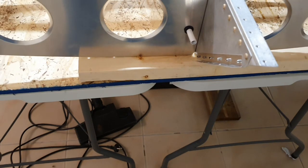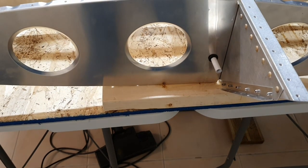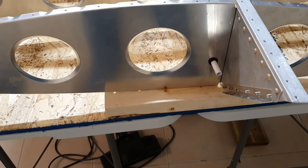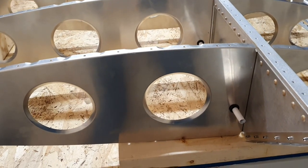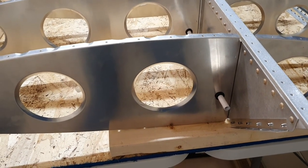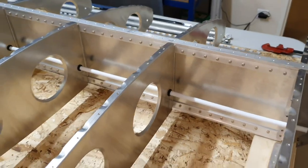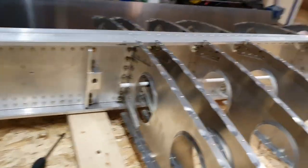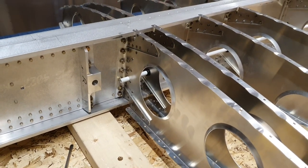The actual lamp is going to be mounted around the widest point of the wing, near the end of the main spar. I'll probably put a piece of string through the middle of the conduit before I seal up the wing, and then when we drill the end to fit the mounting for the wingtip light, we can use the string to pull the cable through. It's strong, it's not going to vibrate, it's nice and tight right through the length of the wing.